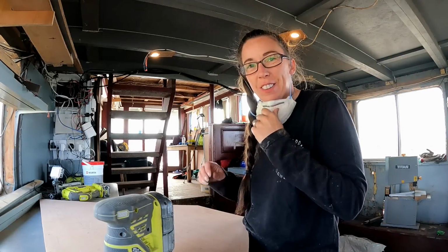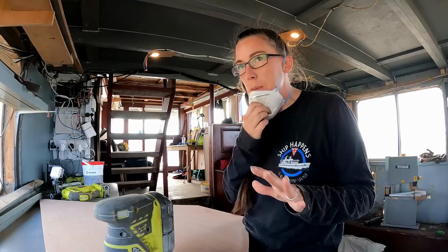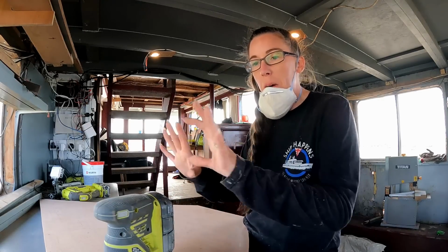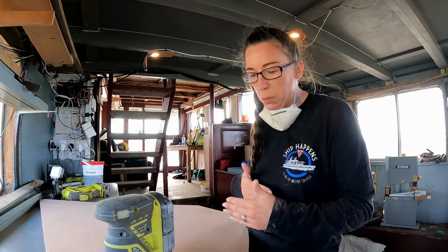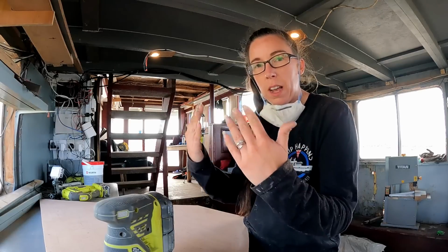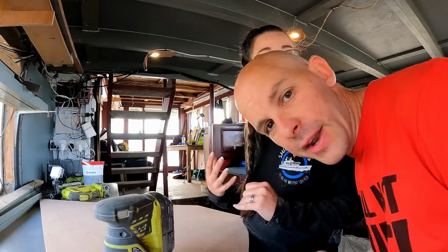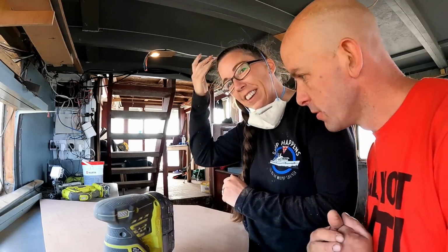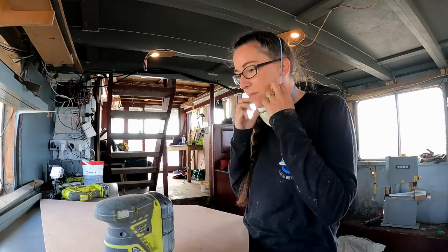So we're making sort of a bulkhead. It's not a watertight bulkhead by any means, but it's just an extra segregation for the ballast and stuff. Because behind this is going to be the water tank, and forwards of it is ballast. So it's just a bit of extra protection so the ballast doesn't move back. Is that right? Yes. And it's a triangle. I like triangles because triangles are strong, so bonus. So that's an extra part to our shuttering. Right, back to sanding.